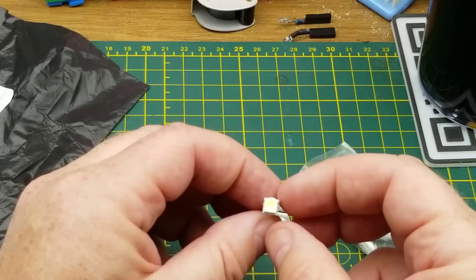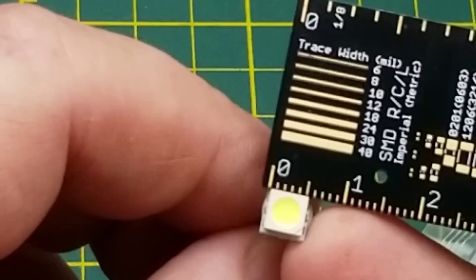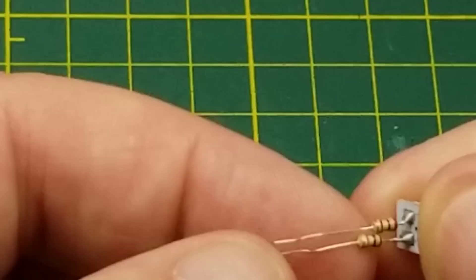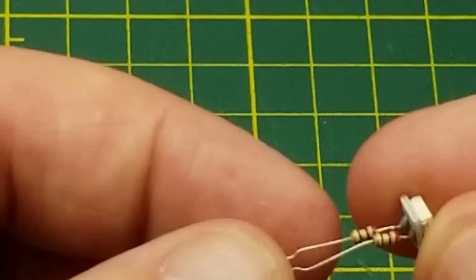They are designed to be operated off 12 volts. The LED package itself is a 5050 package, so five millimeters on each side. I'm going to assume that if I open this up, I'm going to find some steering diodes so that it can be plugged in either way — and a resistor. No, I am wrong. There are simply two resistors in there. So this is obviously a polarized device.